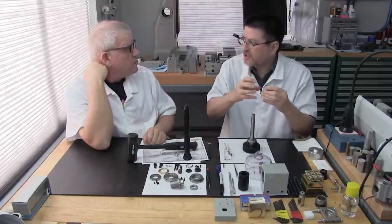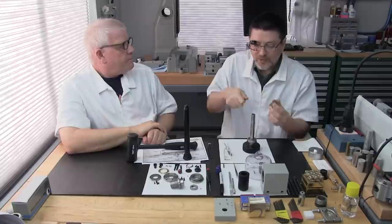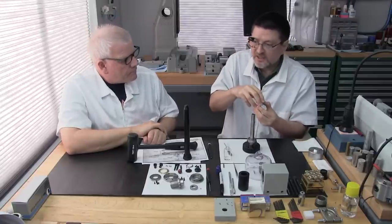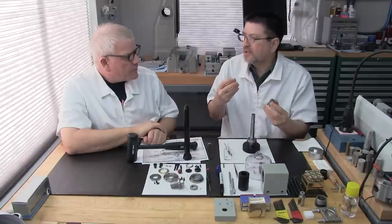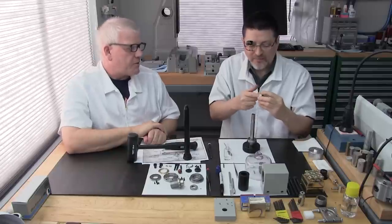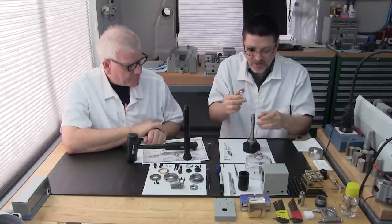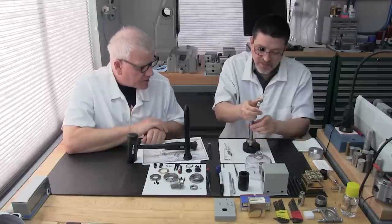You do feel the friction because they're being seated. Basically when we're hammering and they're seated, from the friction they do have a preload on them. But it's not so much of a preload that you can't move both races without any harm. Just want to make sure we answer that question there. Definitely. If you want to get them close, here, I'll make it a little easier on you.